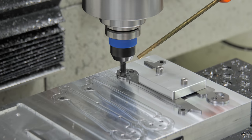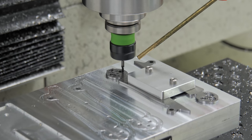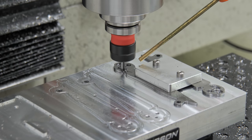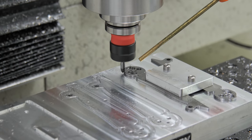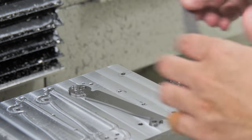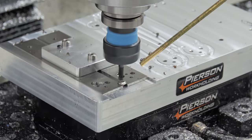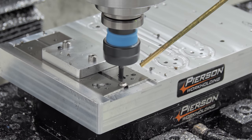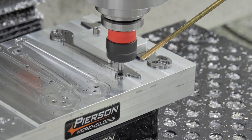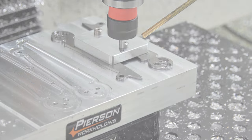Op 3, I machine the magnet pocket and I deburr the outside. I might be able to skip this if I add another tab to the blades. Here's where I would heat treat the part, but I skipped it to focus on machining instead. I wish I went ahead and made each op its own palette. Op 1 is okay, but now to change op 2 or 3, I'll have to scrap this whole palette.